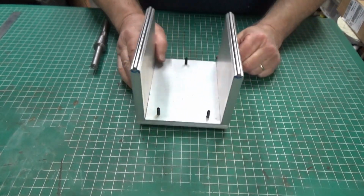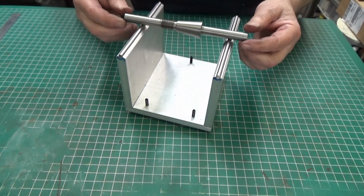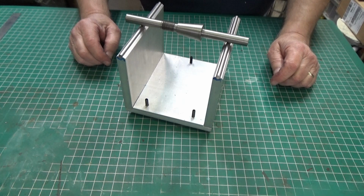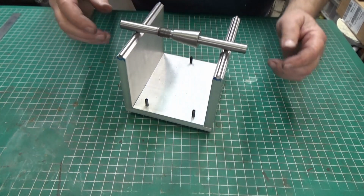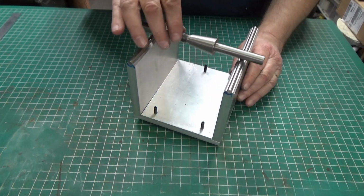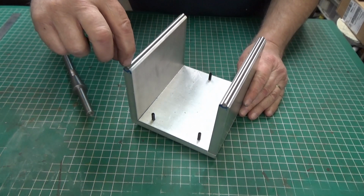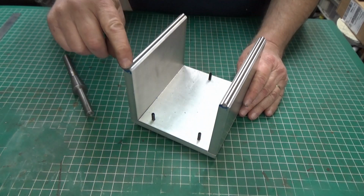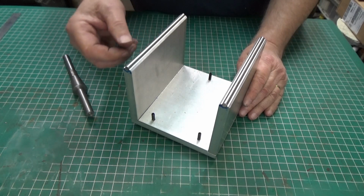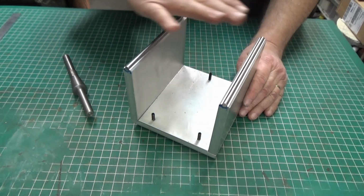This is another project that I've put together for my surface grinder, and this is for balancing the grinding wheels. I turned an arbor that the hubs for the stones will fit on. As it turns out, it ended up not needing the threads, but they're on there just in case. And this is made of 1/2 inch aluminum, and what I did is I grooved out the top edge of it, and these are pieces of drill rod that are actually super glued into the groove that I made on it, and they're perfectly parallel to each other.